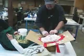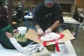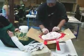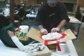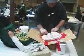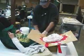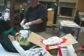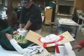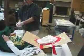Okay, we're back again, and as you can see, we're progressing on building the mother mold. Dave has been using plaster bandages to cover the alginate to make sure that once the piece is completed, we will have a well-formed alginate mold that fits into the plaster mother mold. Therefore, there won't be any distortion of the actual mold.